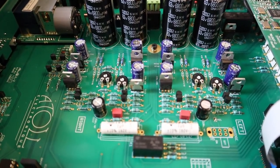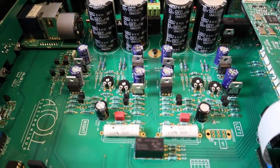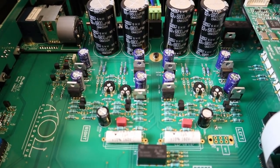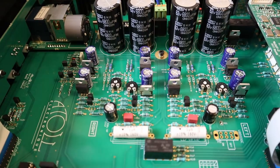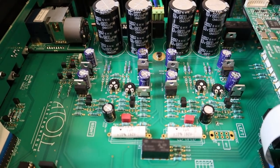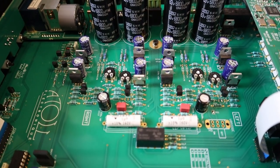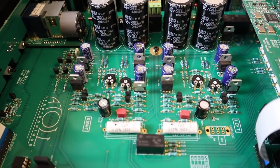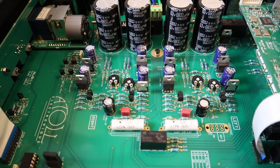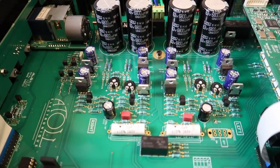That's the power amplifier section. You have an identical module for the left and right sides, nicely separated. What's worth noting here is a fully discrete design, which means you've got no chips, no ICs, and also no surface-mount tiny little parts. It's all through-hole parts, which are generally considered better from a sound quality perspective. There are also two white caps at the front by Vishay, and they've probably used a higher quality part there because those caps are probably in the signal path — likely decoupling capacitors dealing with the DC coming in from the input side, the preamp section.